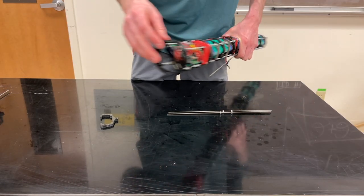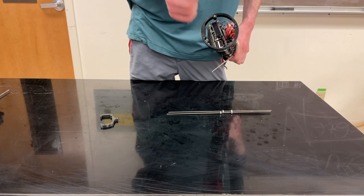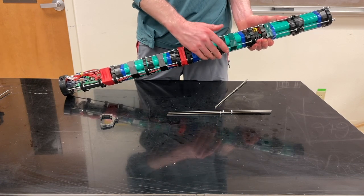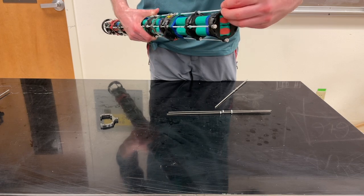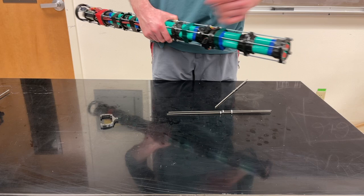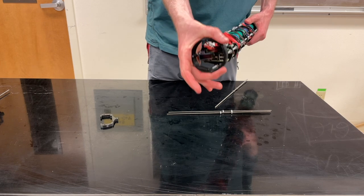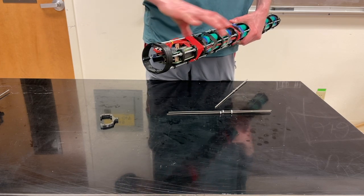To screw the rods into the end of this housing you need to twist each rod individually. I take the very back of the complete setup, loosen all of the bolts, then gently clamp a power drill onto one of these bolts and spin it really slowly. That whole rod will spin through all the housings, threading it into the end component and sucking everything together, and I just space everything out until it's all nicely situated.